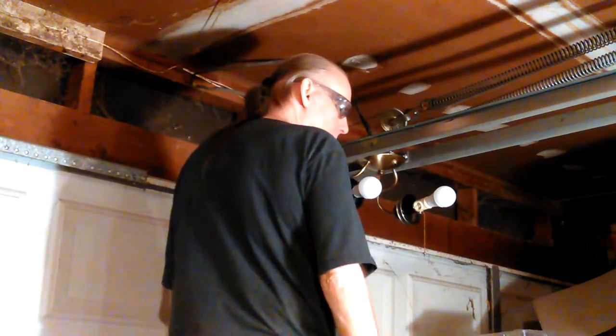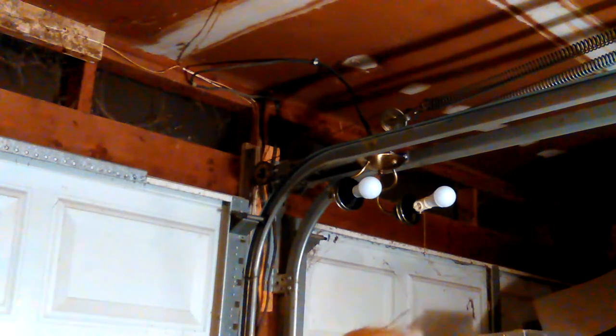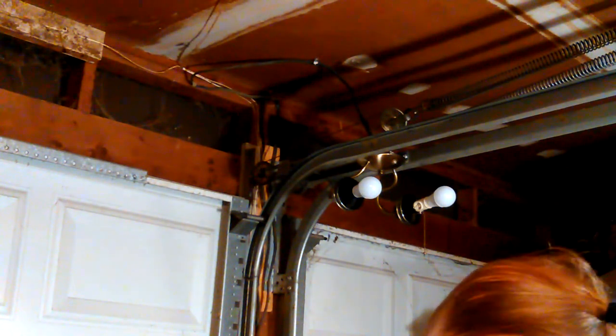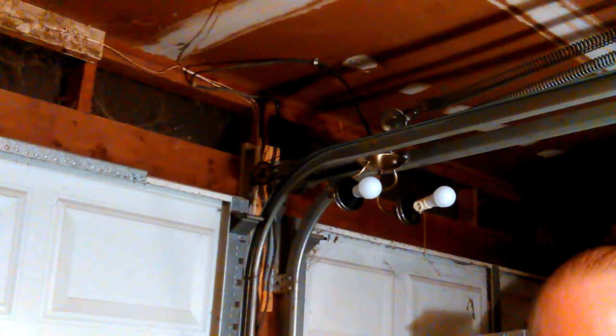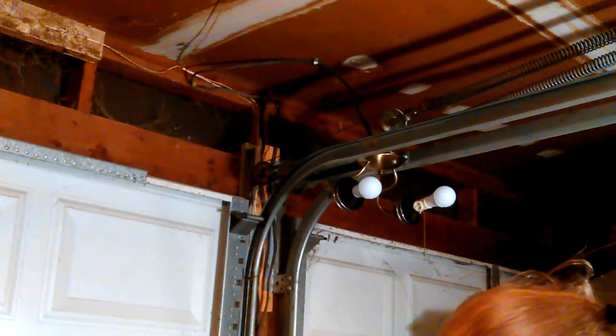Welded a hook on one or both ends, but the more I welded, I finally welded until I ended up cutting it through. I was trying to be careful. Ended up cutting through the wire, and when you heat it up, it loses its tension. But then heating it up, welding on it, made the wire bend. Because that spring, you don't bend that spring. If you were to bend it, like put it in a vise and hit it with a hammer or get vise grips on it, it would just snap. But when I heated it up, I wasn't intentionally heating it up so that I could bend it, but that's what I ended up doing.